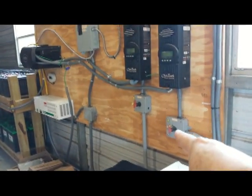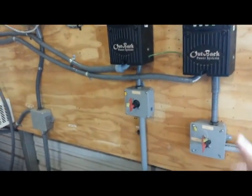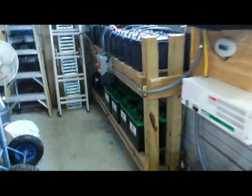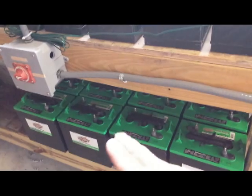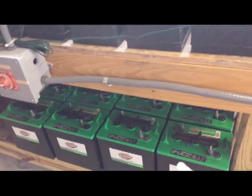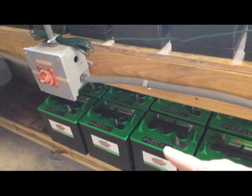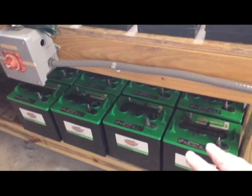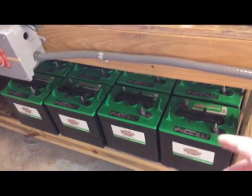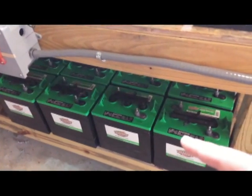You can see the disconnects for the solar panels right here — there are also fuses inside — so I can turn the power on and off at will. I'm doing battery maintenance down here and have to reconfigure them to 48 volts: 6, 12, 18, 24, and so on up to 48 volts. I'm checking water levels, checking specific gravity, then I'll clean up the cables and connect everything.